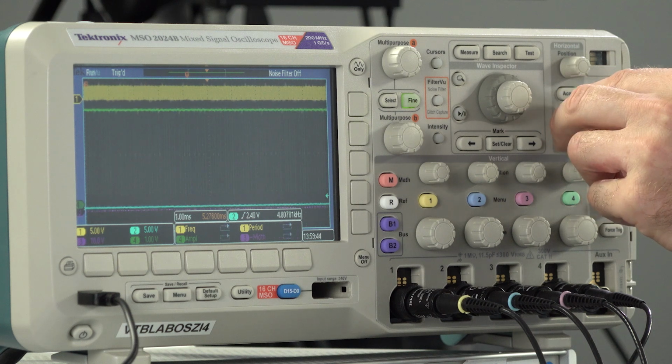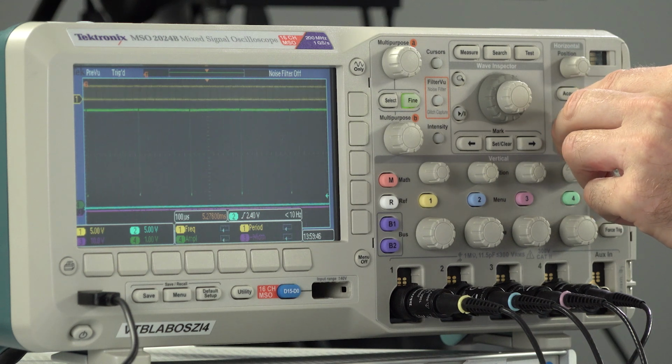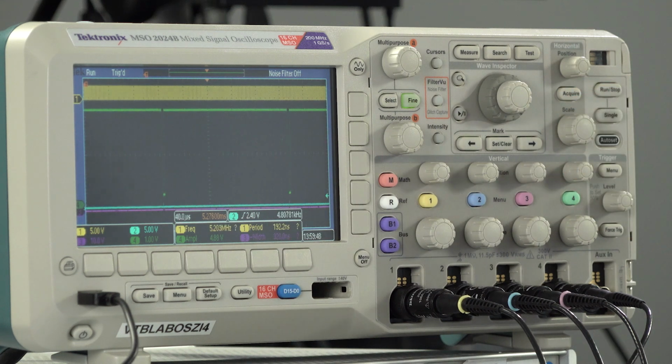And to get more details on the scope, I will change the time base. Zooming in just on a single frame, so with 1024 pixels. And now I'll use the global shutter to limit the exposure within one frame. This should finally give us a good, not saturated signal on our green trace.